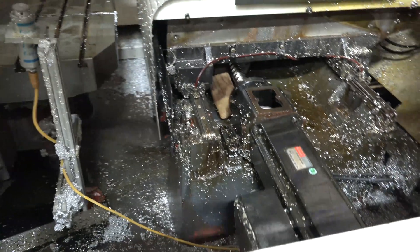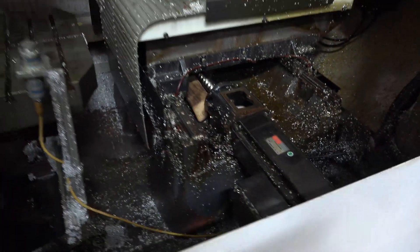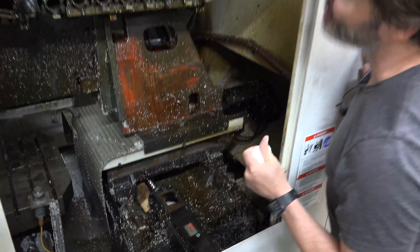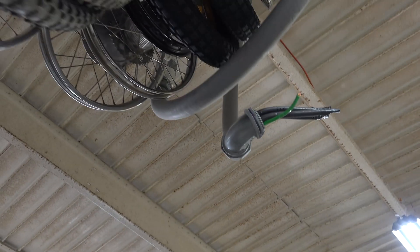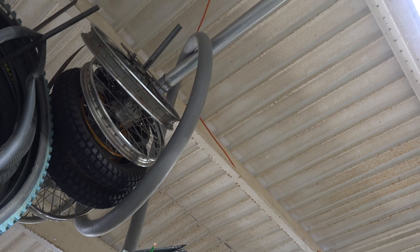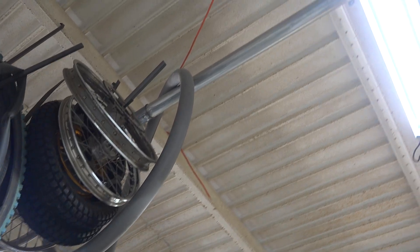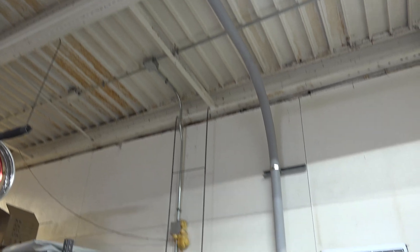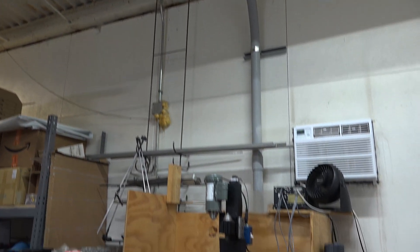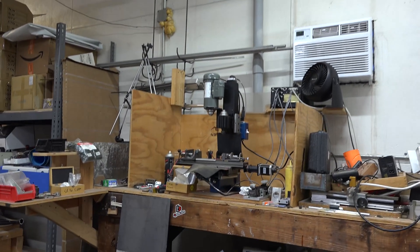It needs a little cleanup — just making sure everything is good before I hook up the power, and that's going to be the next part: hooking up the power. There's the three-phase for the old machine — there was a 125-amp breaker on the machine and I think we pulled 150-amp service on a 200-amp circuit. We're going to have to install basically a new breaker box and pull that down to — I think number eight wire is what we settled on — and pull a new run for it.